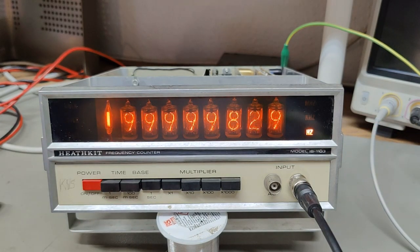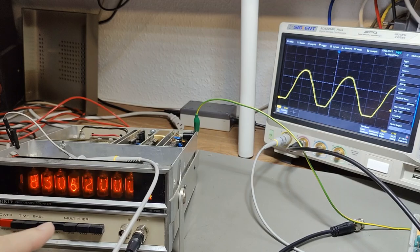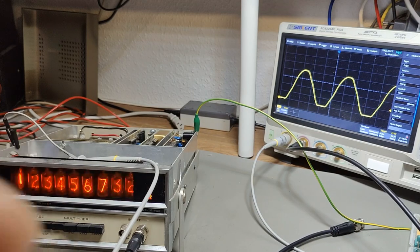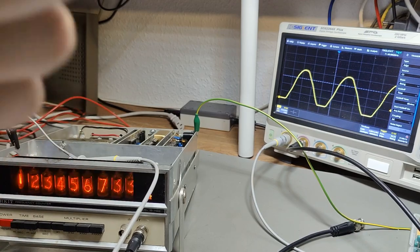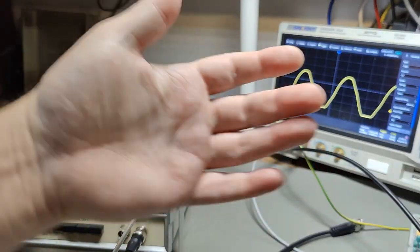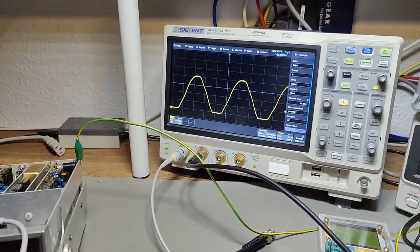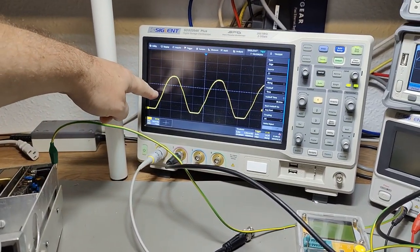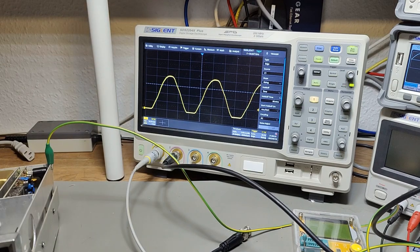This extra neon bulb is also working. It's a little bit too bright for my taste. It really truly works. Let's measure the anode voltage — look how much it blinks, absolutely crazy. I'm running at 60 hertz shutter, so this is of course why we have interference, because I live in 50 hertz land and my camera is set for 60 hertz shutter. Look at that — this is our Nixie voltage, it goes from zero to 200 volts and the average is 100. How ridiculous. That is of course due to the way the power supply is incorrectly made. But we can do better.